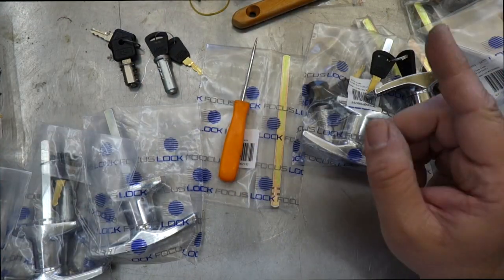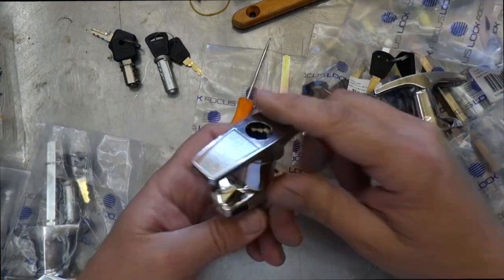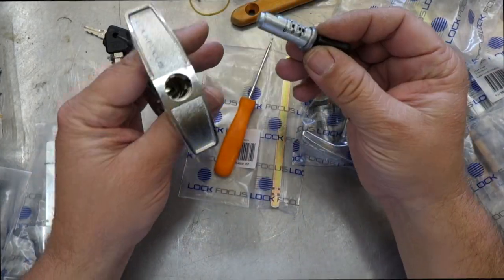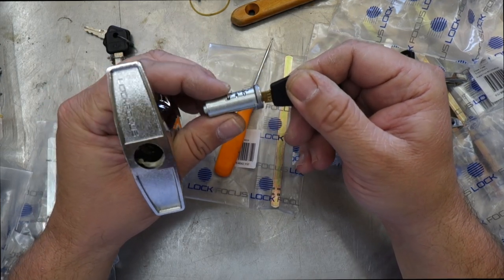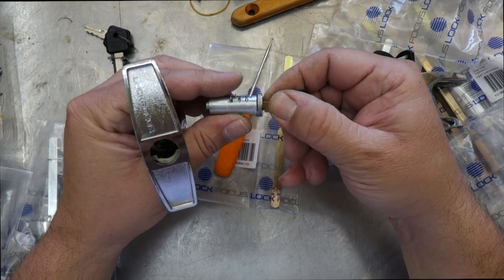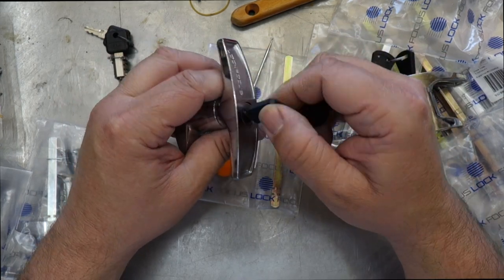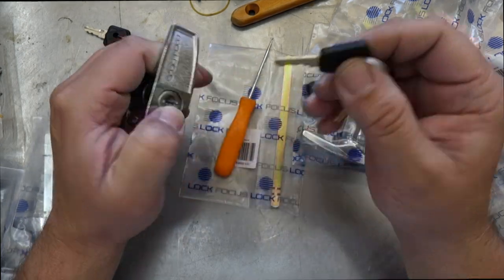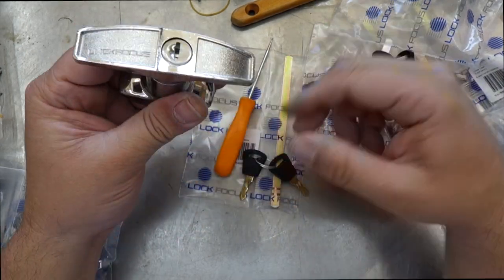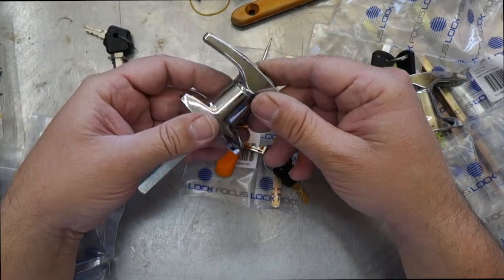So that's removable barrels. To do it on the T-handle: if you get one and can't put the barrel in, simply pull your key out 5mm, push down that last disc at the back, put it back into the lock, rotate it until it's gone down to its furthest lowest position, hold that inner circle, pull the key out, and you are good to go. That's the locked position and that's the unlocked position. Thanks for watching.